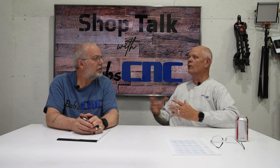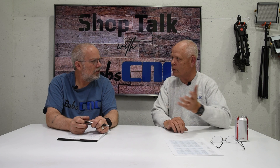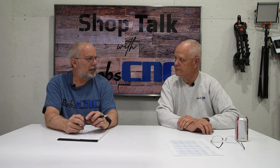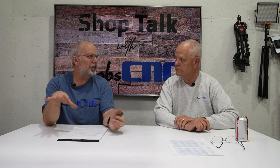Back in the old days when you started, spindle speeds were much lower. We've got spindle speeds now between 13 and 30 thousand RPM. My Bridgeport at home says 4,000 but you'd be crazy to run it at that — maybe 3,000 to 3,500 at most. Old school, since you didn't have very good spindle speed, speeds and feeds are kind of tied together, so you would make really deep passes and just take your time. It was just a different philosophy altogether.